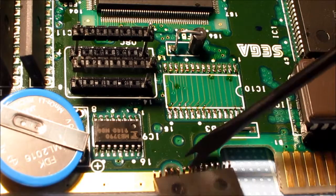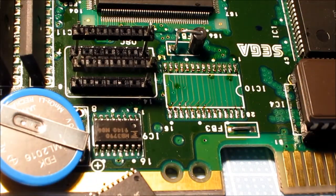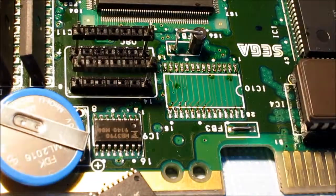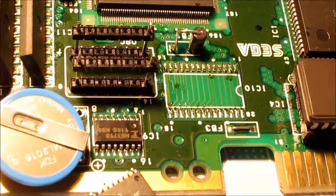So it looks like, at least for this SRAM chip, using standard lead and tin solder, it takes about 500 degrees Celsius on the hot blow function in order to desolder this safely. The tool is a SC7000Z, made by Denon.